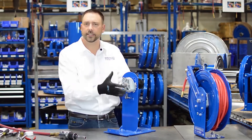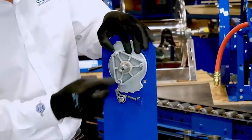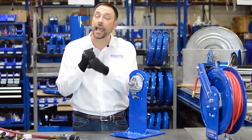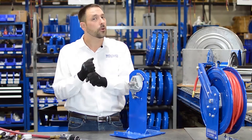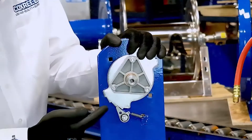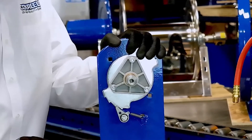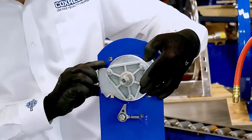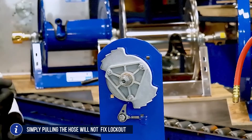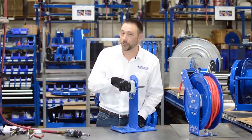Here's a reel without the disc, spring, and drum on it. The way the ratchet works is it goes and latches in place. As you pull the reel out you're eventually going to get to the end of the hose and then you can't pull it anymore. So if you get to the end of the hose at the same time you end up in a ratchet position, that's called lockout. The only thing you can do is turn the drum a little more by hand to rewind it, but you can't do it by pulling on the hose because you're at the end of the hose.